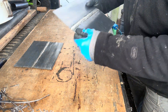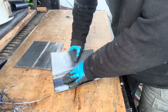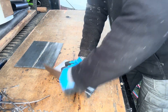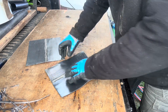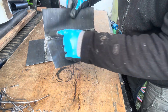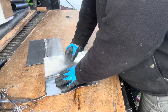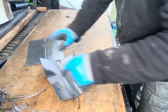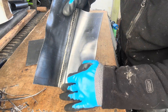Let's start with this lap weld first. What I'm going to try and do is basically just keep wiggling it on the weld to try to get it to snap. The trouble is, it's not wanting to do that because the weld is so thick — the piece of lead there is choosing to bend before the weld. So yeah, it's actually getting a weak spot, which is way before the weld.